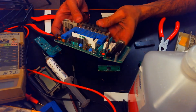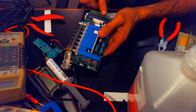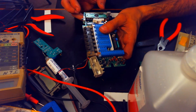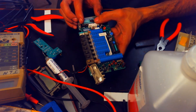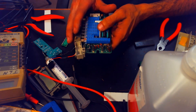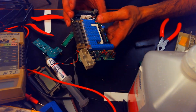Just to wrap this video up — I really don't think it was the greatest idea to try to do this jumper wire into the socket approach. So in the future we may actually remove the socket and solder the chip directly to the PCB. Before we do that, we may try to tackle another 8020B repair, probably the button repair. We may use this donor meter to swap a button out, or we may just try to get that button working. We'll figure it out when we get to it. Thanks for watching!